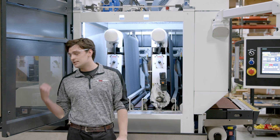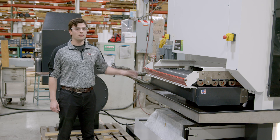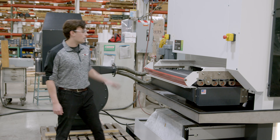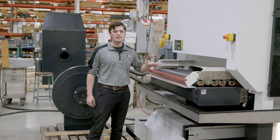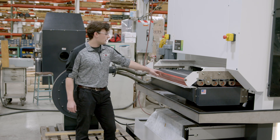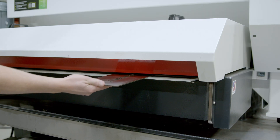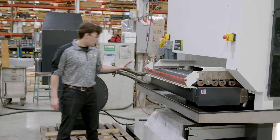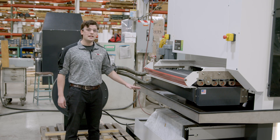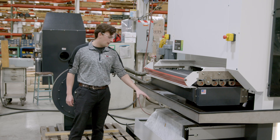Now let's take a look at the back side of the machine. We have our air knife parts dryer and squeegee rolls, which clean and dry the parts as they exit the machine. There is an over-thick bar safety feature for return conveyance. We have a stand-alone blower for the air knife parts dryer, and we also have an auto-advancing paper media filter that filters out the metal swarf through the machine, auto-advances, and collects in this bin.